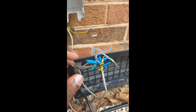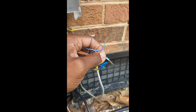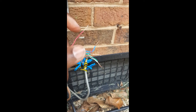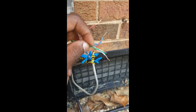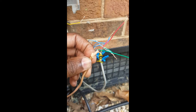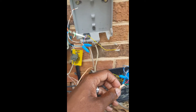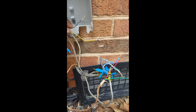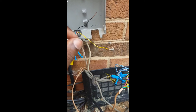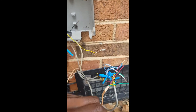As you can see I've twisted the blues with the red, the white-blues with the green. This other wire here — I'm going to twist the red onto here and the green with the white-and-blues, and that'll put all of the house phones together. I'm assuming this is an extra line they ran for another jack somewhere in the house. I previously touched all of them to my yellow and black coming from the alarm, and it didn't short out or do anything, so that lets me know all of the lines should be in good shape.